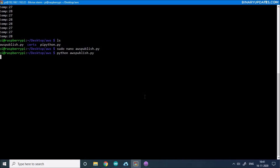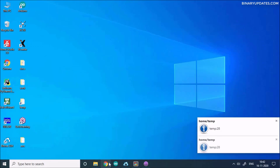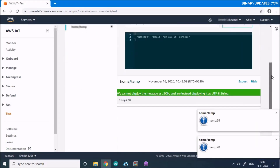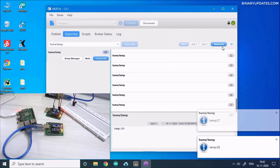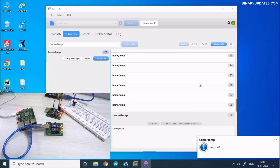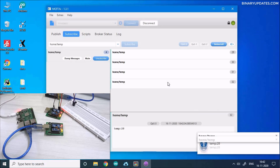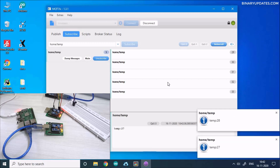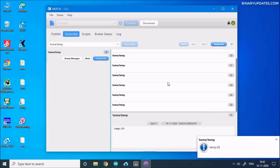We use client.publish() to publish the data variable to the 'home/temp' topic. When we run the script with python aws_publish.py, the temperature prints in the terminal, and simultaneously if you go to your AWS account you can see the data streaming to the cloud and also coming to the front-end client application — you can see the data streaming nicely from AWS to the Windows machine and Qt application. If you need help implementing this project or want to learn core IoT and embedded systems concepts, check the link in the description or contact me. Thank you and I hope you found this video educational.